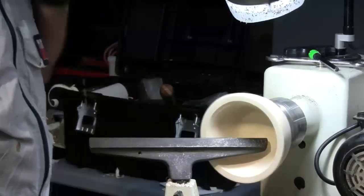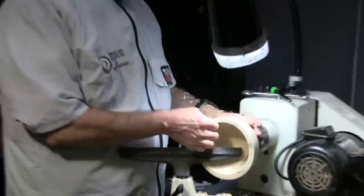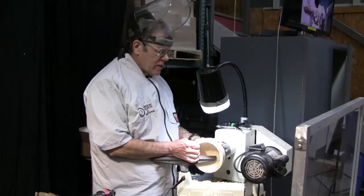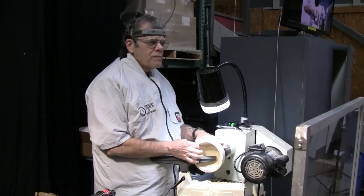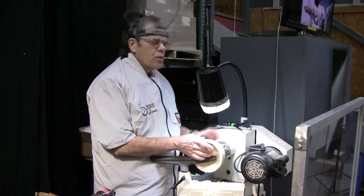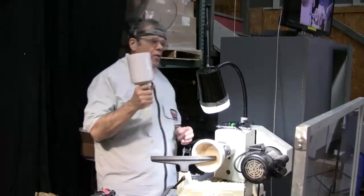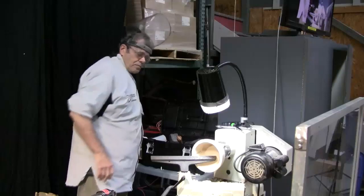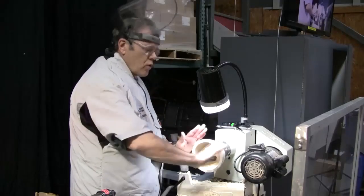I talked about putting anchor seal on it — you all know what I mean by anchor seal, it's a wax emulsion. It's fairly pricey, but you can buy it in bulk and break it down by the gallon and it's not too bad. You don't have to use that. I just find sometimes I do, sometimes I don't — it depends on the wood, the time of year, and how I'm going to dry it. A lot of times I don't put any on it, but shrink wrap tape tends to work pretty well too and it's fast. I normally don't put any on the inside; I just put it on the outside to force the drying on the inside.